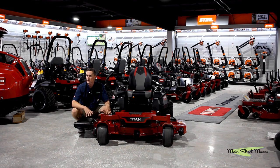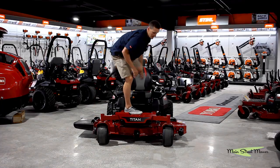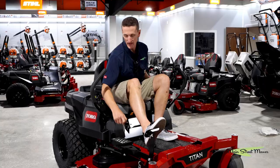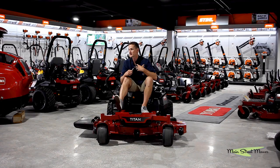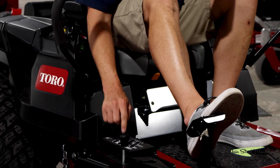Because of all the reinforcement, this deck is a lot heavier than a Time Cutter deck, so it also comes with a foot lift pedal. From the seat you can lift the deck using your foot, which is much more powerful than your arm. This is your height of cut setting pin — it's magnetized and has a nicely gridded system giving you quarter inch cutting increments. A lot of people want quarter inch adjustments. I personally love cutting at three and three quarters, and on a Time Cutter you'd have to choose three and a half or four. This gets you to three and three quarters using the three inch and three quarter inch settings, then you drop the deck down to that cutting height.